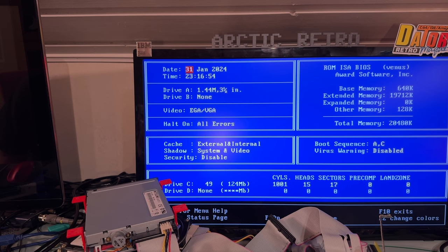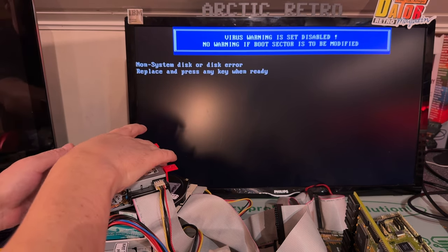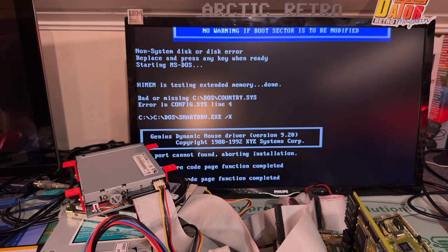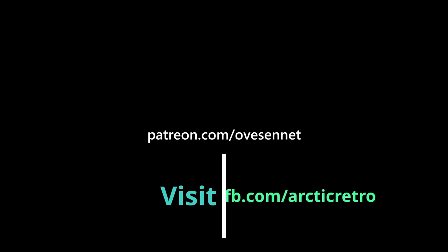I'm going to hook up the hard drive and now it should boot straight in without needing to go into the BIOS first. There's a floppy, so it's trying to boot from that, but it couldn't read it. Now it boots from the hard drive — yes, that worked. That was it for this video. I modified the Dallas real-time clock chip to continue working with an external battery. It was kind of a little bit of brute force, but it worked. I hope you learned something and now you know how to do this yourself. Thanks a lot for watching — please hit subscribe and the like buttons. Thanks again, and a special thanks to my patrons. Bye bye.